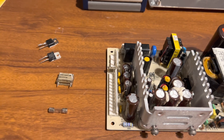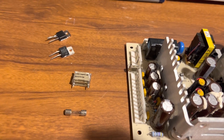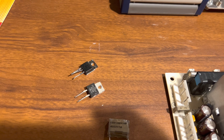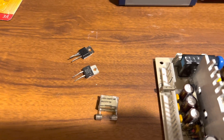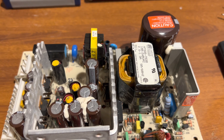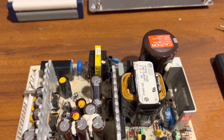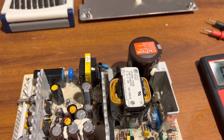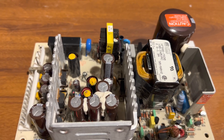Unfortunately, this Rifa cap also took out the MOSFET right here — it's dead shorted on all the leads — and it also took out this rectifier diode, which is also dead shorted. It's effectively a wire instead of a diode, so that's no good. Thankfully, from testing I didn't see any other bad components. I went ahead and tested everything on that rail — everything else tested good, including the main filter cap on that rail. I took out pretty much all the components, circuit-tested them, and they tested good. The Wima caps and all the rest of the transistors are good as well.